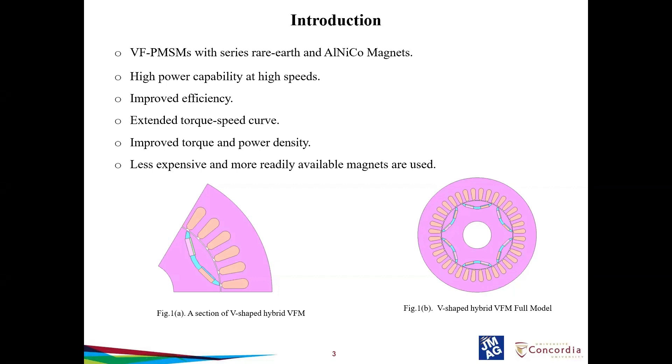The replacement for rare earth permanent magnets makes ferrite a better option. Ferrite magnets are inexpensive; however, a reduction of the torque component is unavoidable when ferrite magnets are adopted since ferrite magnets have lesser Br when compared to rare earth magnet topologies. Low coercive magnets such as Alnico and Samarium Cobalt can provide comparative magnet flux density to rare earth magnets. Variable flux machines are best suitable for the wide speed operating range, and Alnico will be a replacement for the rare earth magnet, offering a better option for the flux weakening mode, which is the main aspect for traction motors.